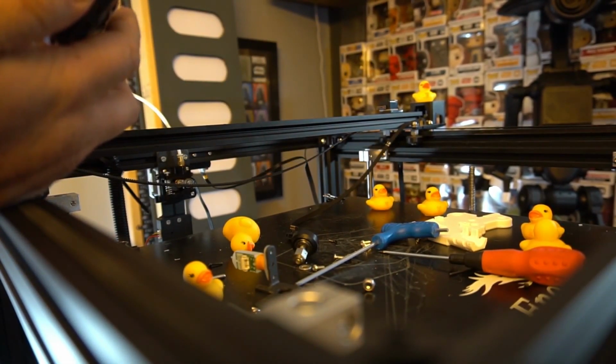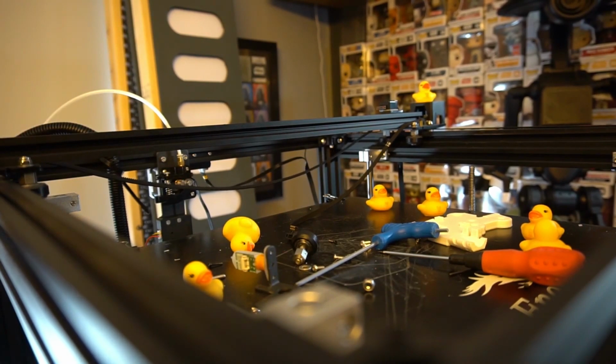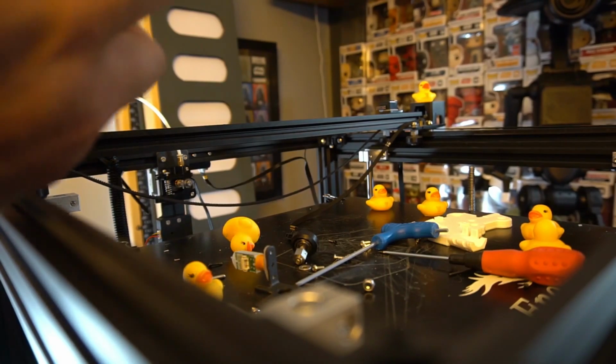So what are the issues that I had? Well, I did have my first sense of humour failure this year with this particular hot end. After the install, I heated the hot end up, but was not able to reach more than 150 degrees before it errored. To which I said, it's got to be software, right?